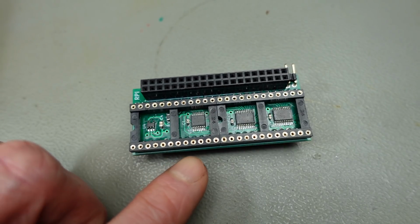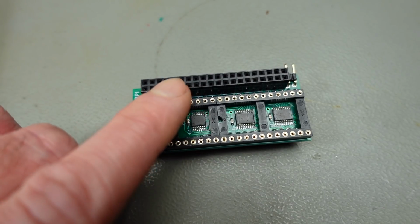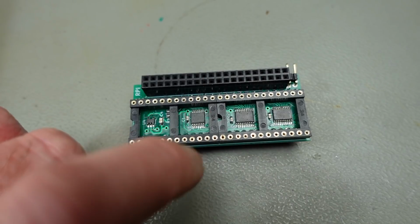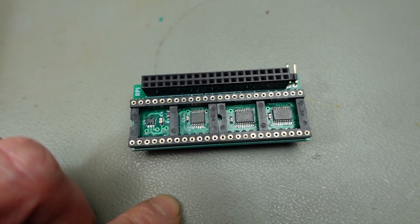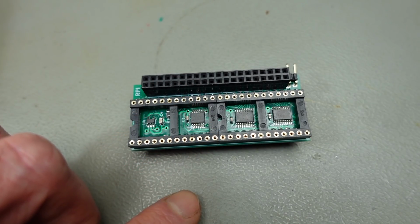And it's just taking the RGB signals from the Denise, converting them to a format that the Raspberry Pi can understand, and outputting them into the GPIO pins of the Raspberry Pi. And then the magic is happening in the bare metal software on the Raspberry Pi, and the Raspberry Pi should output an HDMI signal through the little mini HDMI port.